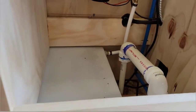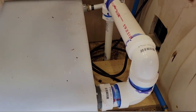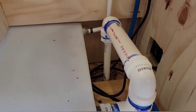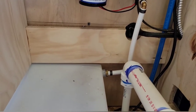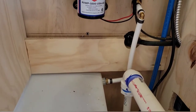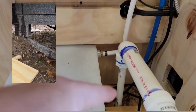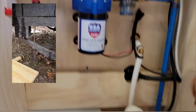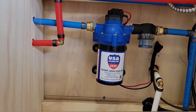Holding tank for our water with an overflow that we built right here. As the water comes in, we needed a place for the air to escape, otherwise our tank expands. Then the water will be able to flow out onto the ground after the air has escaped. And that's going to stop any accidents from happening if the valve is left open and water is left flowing accidentally.